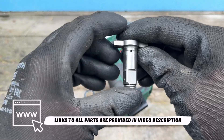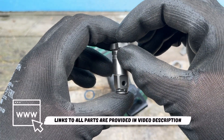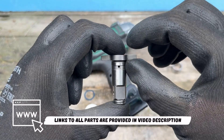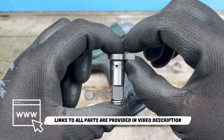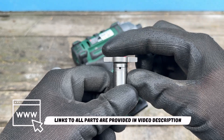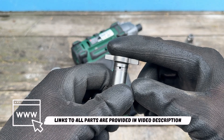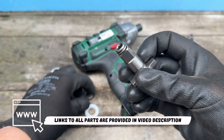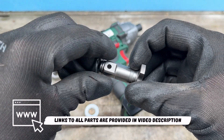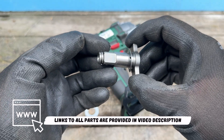The other option is an anvil with a 16-millimeter shaft diameter that comes with a base height of 6 millimeters. If you get it with the 6-millimeter base height, you've got two options: you can either remove one millimeter on a bench grinder, or you can keep the 6-millimeter base height and use a 1-millimeter washer instead of the original 2-millimeter one. Links for all of this are in the video description.